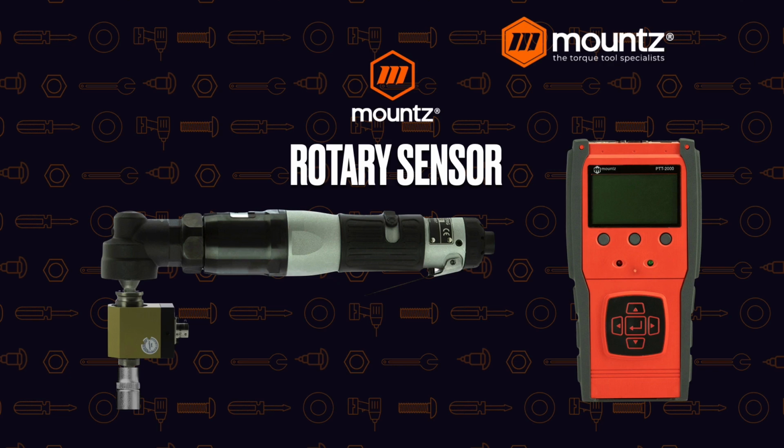And so this differs slightly from if this tool is sent out for calibration, because the calibration, whether it's in-house or if it's going to be sent out to another lab, they are going to be testing that tool on a joint simulator. And that simulator may not have the same characteristics as the actual joint that's being used. So if we have the ability to use a rotary sensor, the big advantage is that we can use it actually on our part, and we can tell the amount of torque that we are getting on our application, not just on the joint simulator.